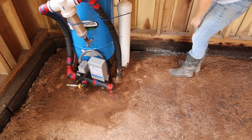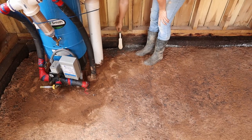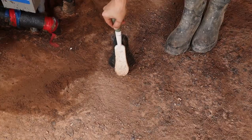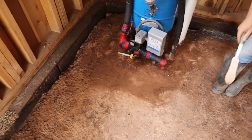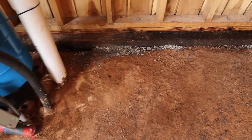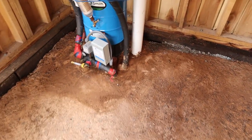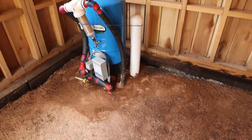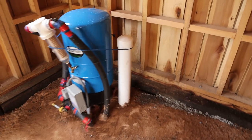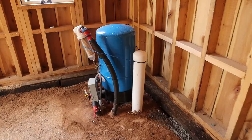So Meg, put the broom down where the bottom plate's gonna go. It's gonna go like here, about there, to like here. And then it'll shoot over that way. We just need to make a quick L out of some 2x4s, because from the bottom of our awful slab to the railroad tie, that's 2 inches. So if we do 2 inches all the way around, then we could pour our cement, and then we can just have that footer in place for the walls for this little closet. So I'm gonna take care of that real quick. Should just be 2 cuts.